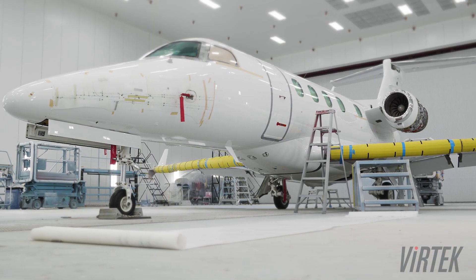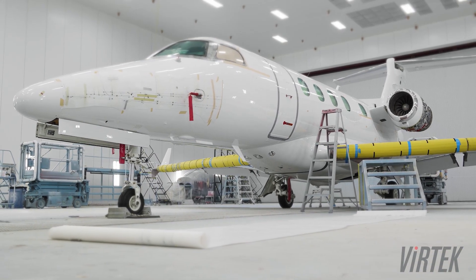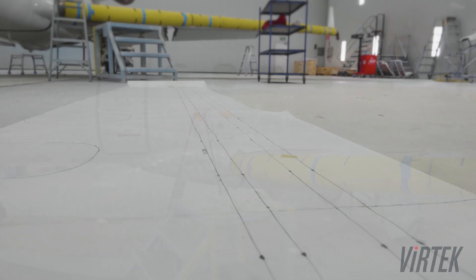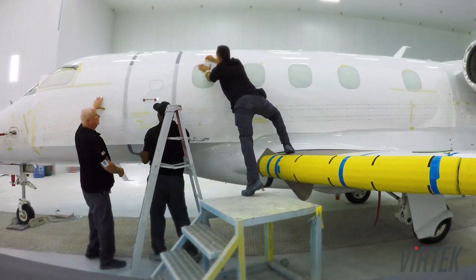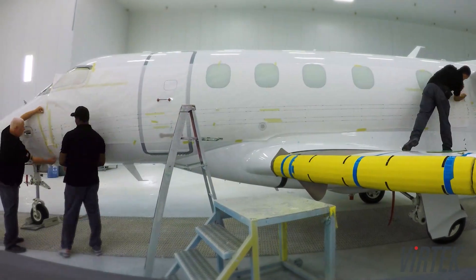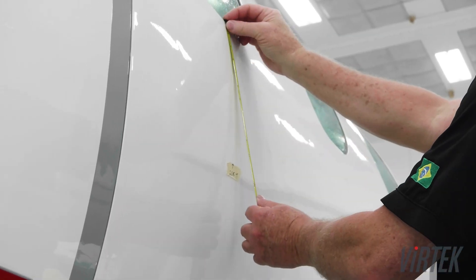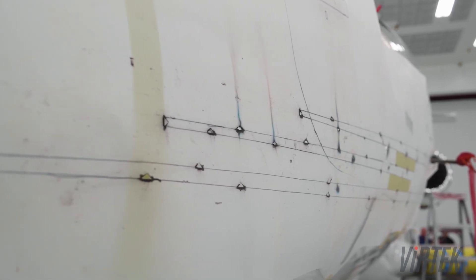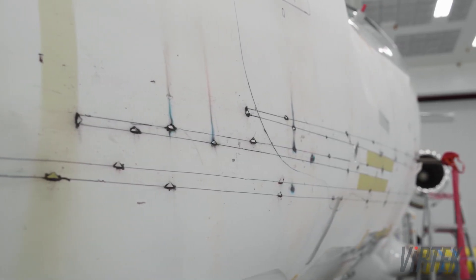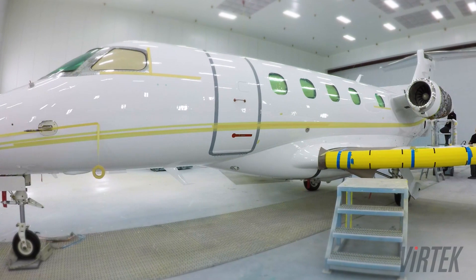Typically, this was how the paint process worked for five or six years, and it's typical with this process throughout the aviation industry. First, the aircraft has a design, and then a mylar that represents that design is placed on the aircraft. We locate it two dimensions per blueprint, then we put a series of dots on it and basically connect the dots using fine line tape.